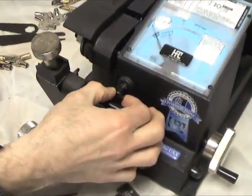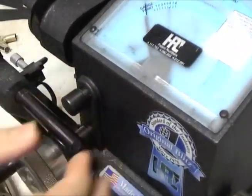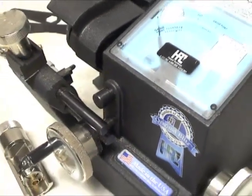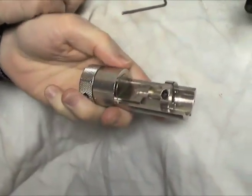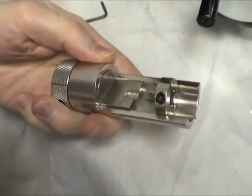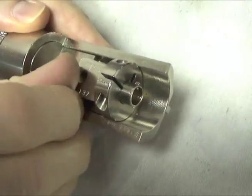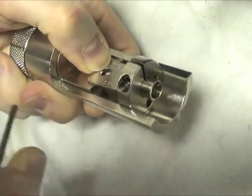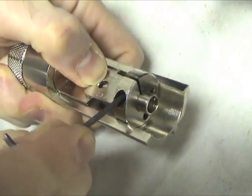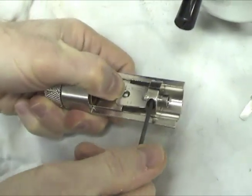Place the cap on the plunger. This will hold the carriage at the proper distance for using the adapter. Loosen the set screw on the adapter using the Allen wrench provided, and place a tubular key blank in the adapter. Remember, HPC offers both brass and steel tubular blanks. Push the blank forward toward the open end until it stops, then tighten the set screw.